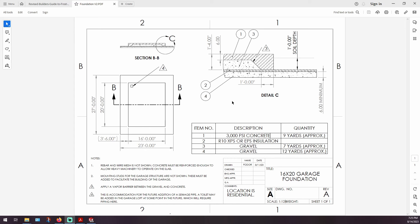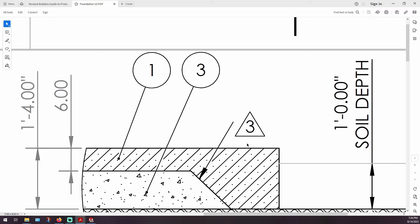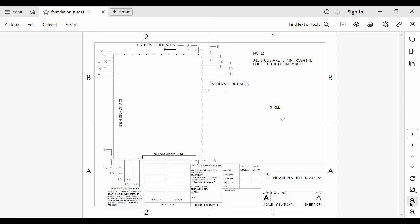After I was satisfied with the design, I created an engineering drawing and sent it out to contractors to bid on the work. Note the 3,000 psi spec for the concrete — I actually ended up going with 5,000. I also left a lot of details up to the contractor, such as rebar, concrete anchors, the insulation, and the vapor barrier. Something that came in really handy was SolidWorks's ability to estimate the volume of gravel and concrete I would need — my contractor commented that these quantities were pretty spot on.